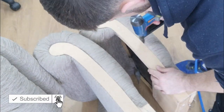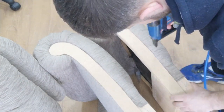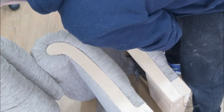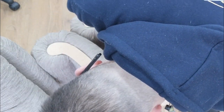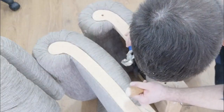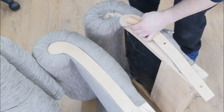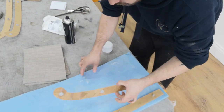I've put on the facing, putting a few extra staples in to make the space for the piping to fit — it has to fit into the ridge. Then I'm drilling holes for the grommet to go in. I do apologize about the camera angle here. The grommets are basically little trees — they also use them on car panels — they go into the wood and hold the panel in. You push it into the wood, put the foam and fabric on, and then push it on when it's all done. You can see the little gray things — those are the grommets.